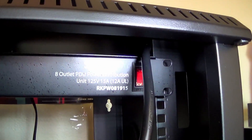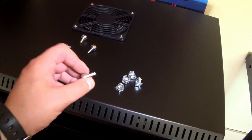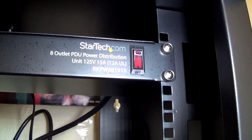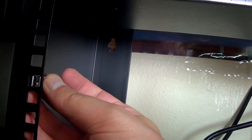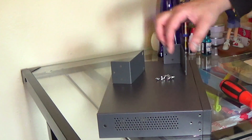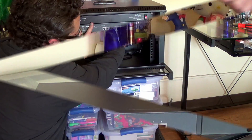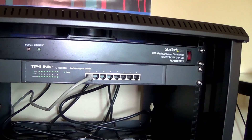So I'm getting this put together here. Got the power in here, but it won't go in there because it's hitting the fan — the designer should have put it a little further back. Now I've never done this before, but these are the screws that come with it. The screws go through to the front of the device, and this is what you screw into in the back. They actually just snap in like this. Now it's time to put the brackets onto the switch. Brackets are installed. Let's mount her in the rack. The switch is now installed — one plug to get the internet.